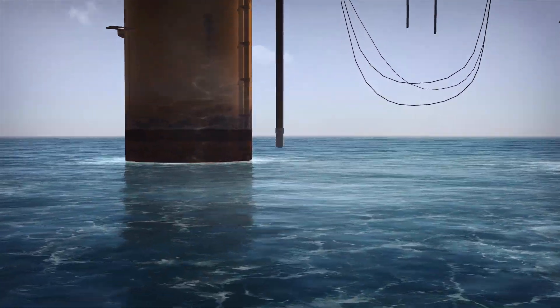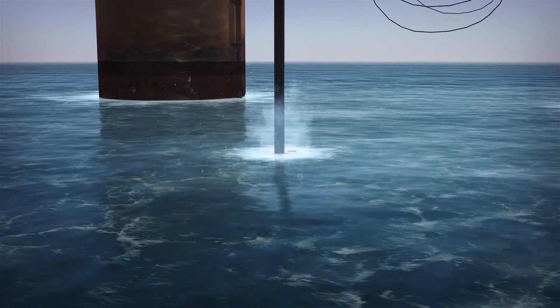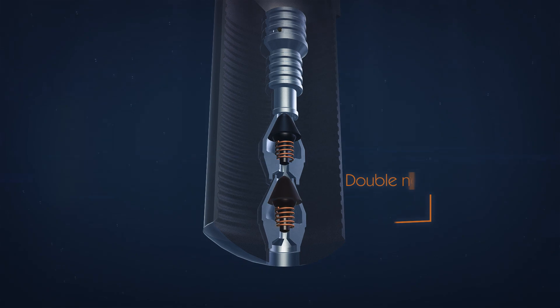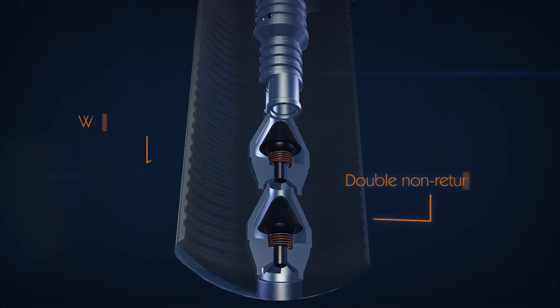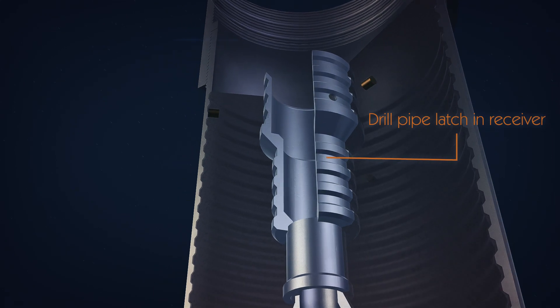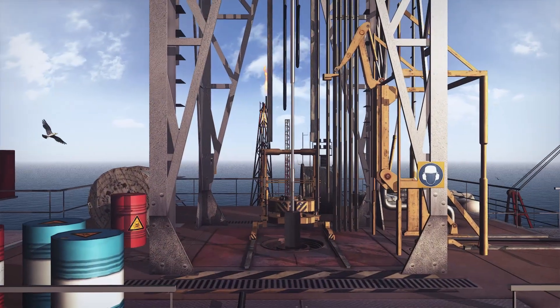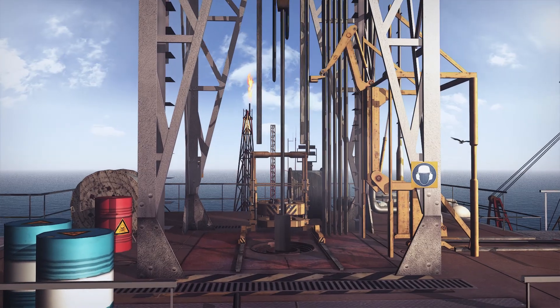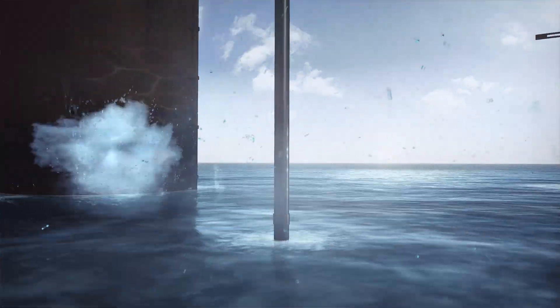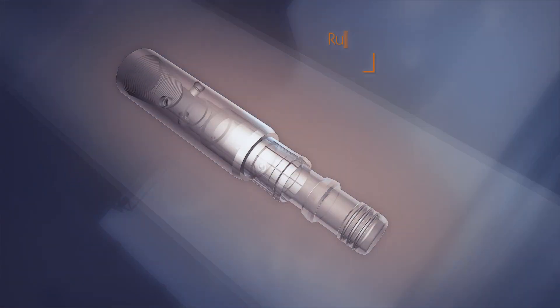At the rig floor, a casing or liner is run with a C-Cure Float Shoe or Float Collar — a standard API RP-10F CAT 3C certified double non-return valve with wiper dart receiver and drill pipe latch and receiver, complete with backup release shear out feature. The C-Cure assembly, complete with slip joint tool, weight set sub, and latch and adapter, is run into the casing complete with rupture discs pre-installed.